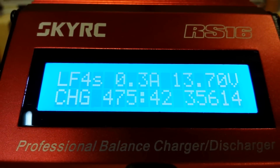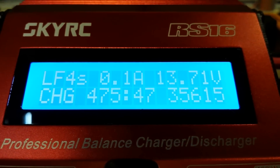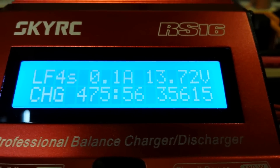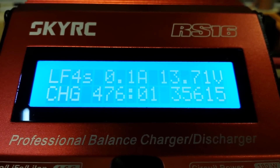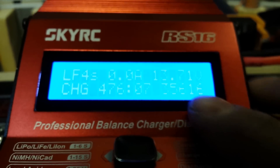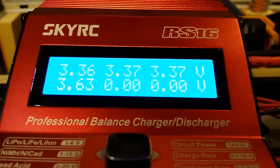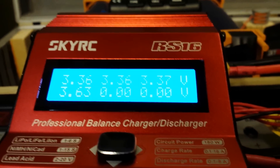It does appear that after around seven hours charging at 7 amp, it's put in 35.6 amp-hours, and it's hovering around the low end so it's probably just finishing off its charge now. The balance of the cells is quite out of whack — one at 13.63 on the high side and the rest are level, so we may have to balance charge these next time, which might take a little bit longer.